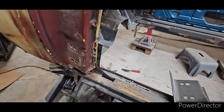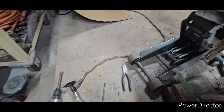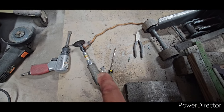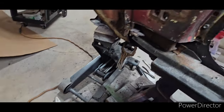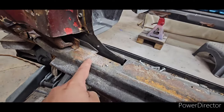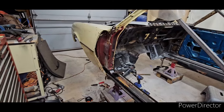Take your time as you cut. I use my angle grinder here, and also this air grinder. I use the air hammer to chisel the original spot welds. I will start cleaning here also because it needs to be nice clean metal for when I'm going to weld.